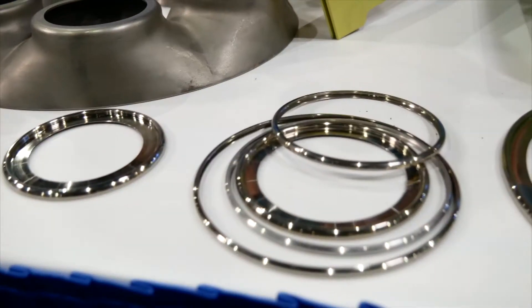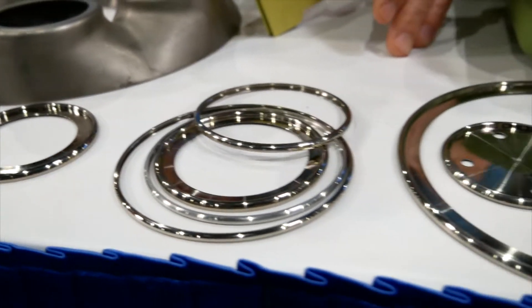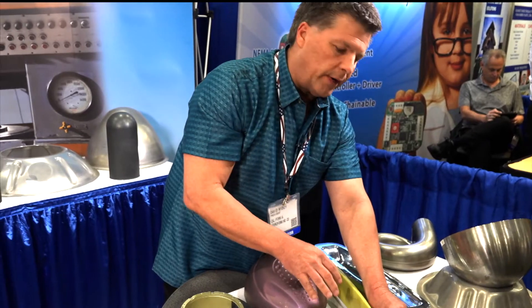These here go into APU units and they're stainless steel 300 series, different configurations. We have a hula hoop shape and a flat surface. It starts out as a can, and then we do trimming, and then we put in a bulge die. The bulge die gives you the final shape. They're tight tolerance — about two thousandths on diameters that we have to maintain.